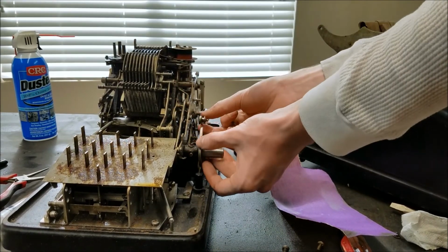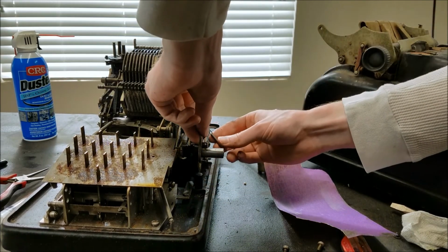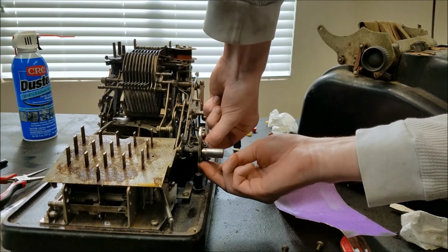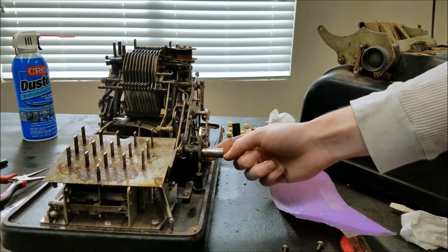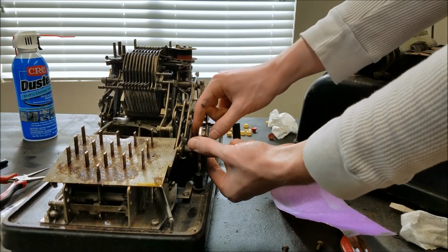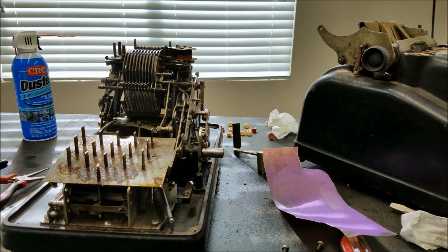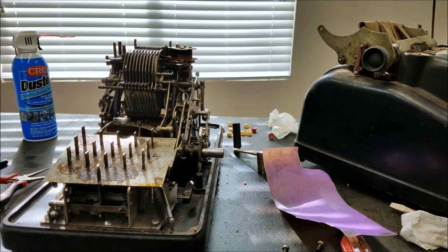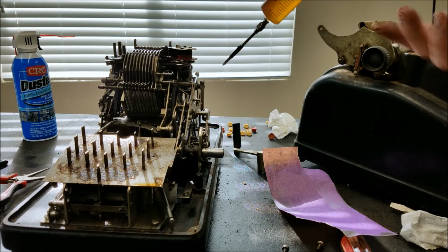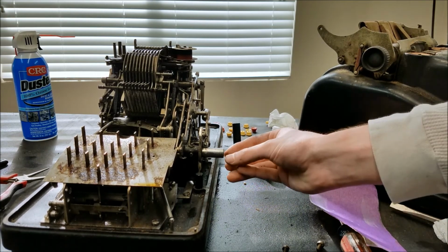You can see this thing here goes in that groove there, and then there's a spring that goes from a pin on the shaft down to a little post on this piece so that it holds the shaft in. So that if you move this to an open space, the shaft, see, is still held in the groove, it doesn't fall out of the groove. So I'll also dump some oil on that. So that's all lubricated. And then there's a screw, which goes in the end here.